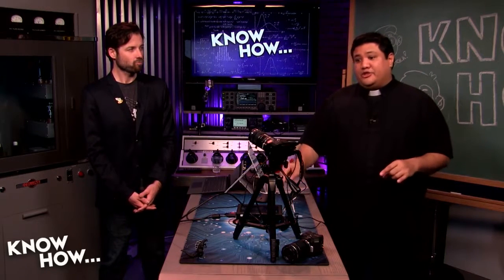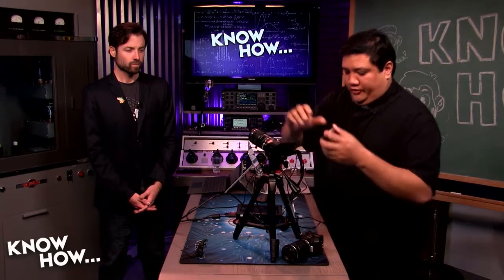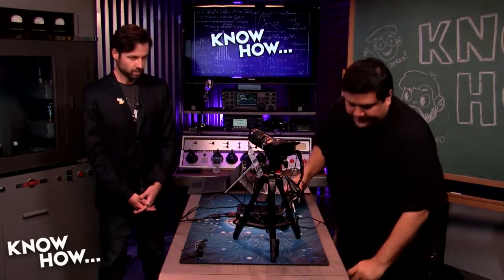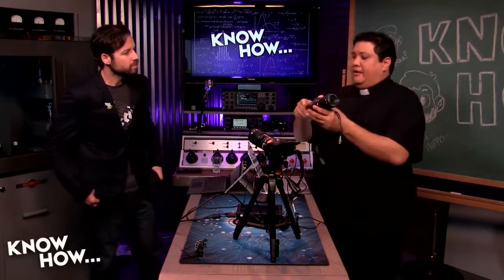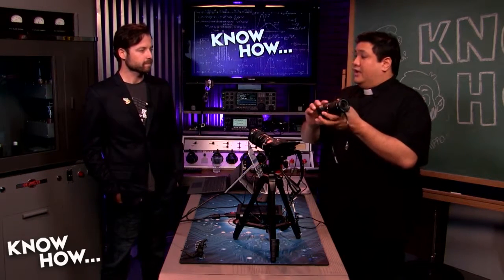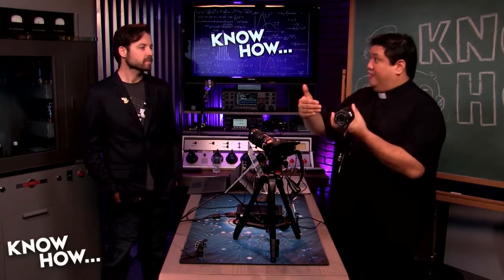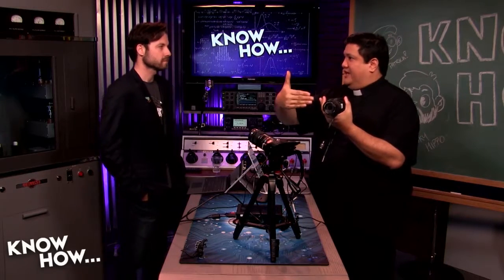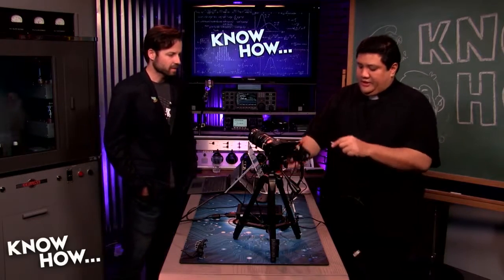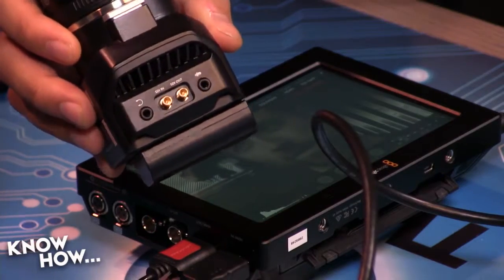The information you can get off this is phenomenal. What I want to do now is swap this over and show you what it will do for 4K. Remember, with the studio camera, the HDMI output is always going to be 1080. The SDI output can go up to 4K, which is nice. I can do dual output — studio monitors at 1080, but send to my switcher in 4K, or vice versa, whatever I want to do.